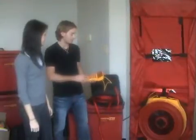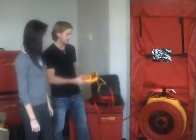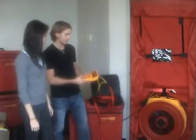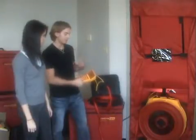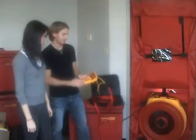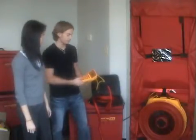Now we're going to turn the fan on to establish a pressure difference. There are two ways to do that: using the set speed feature or the set pressure feature. I'm going to start by using the set pressure feature to establish a pressure difference between the inside of this enclosure and the outside. Let's create a pressure difference of 10 pascals — press 10, then Enter. The fan will now turn on to create that pressure difference. Once we get up to the pressure we want, we can increase it in increments of 5 using the jog feature. You can ramp that up to 15, 20, 25, and so forth. You can even hold the up or down arrow to go up in increments of 10. This is useful for a multipoint test where you want to take many different readings over a set pressure span.